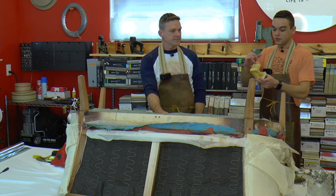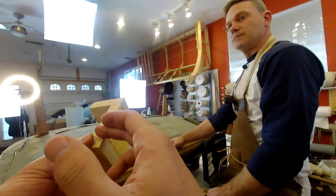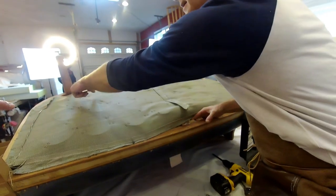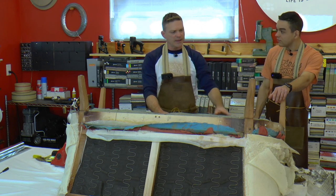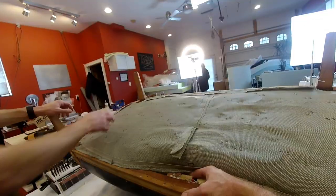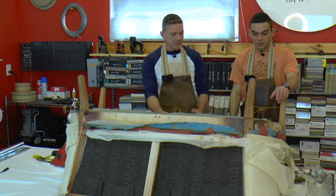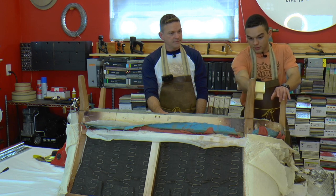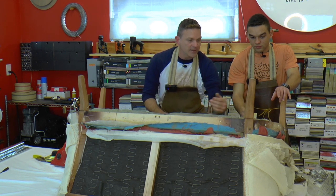I'll be done soon — I just need to do like two more cuts for the top part, then sand it down so it's nice and even. I keep staring over here because I've got a leg in the back — when I put a webbing strip here I'm going to have to staple right to it. I'm guessing they only had six straps — I don't think there was one here; maybe the others fell off or were pulled off. Maybe I can angle the webbing like this or go straight here and then work around this leg and staple to it. I've done that and seen that before.